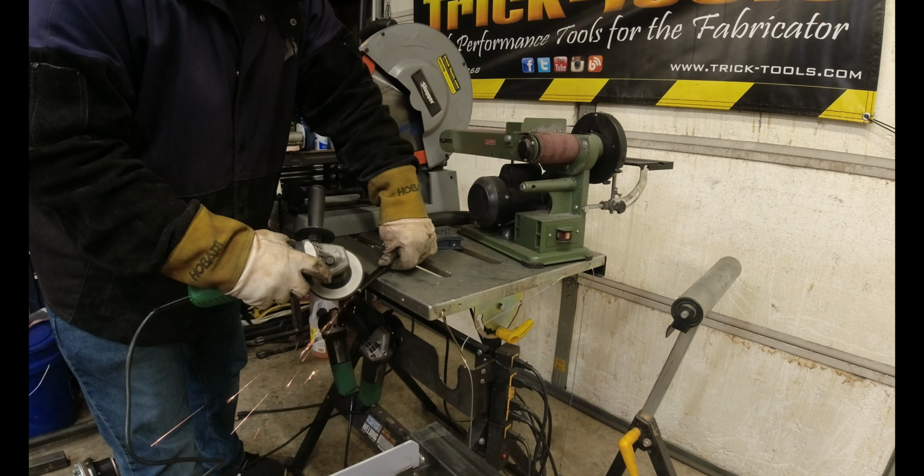if you have something that you have to weld at an odd angle, this is a finger brake we made for our custom bender. This way it sets up on an angle and I can just go through and weld it real easy. And you can build these at any angle. Just take one of their clamps and a bolt and you decide what angle it needs to go at.